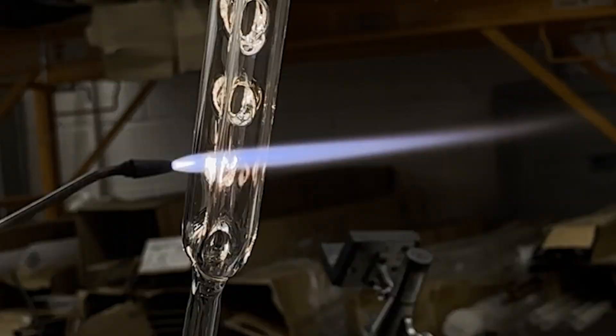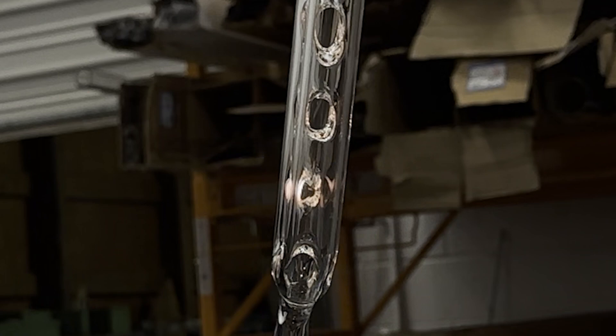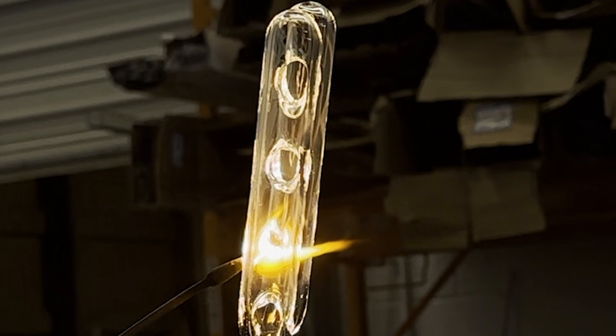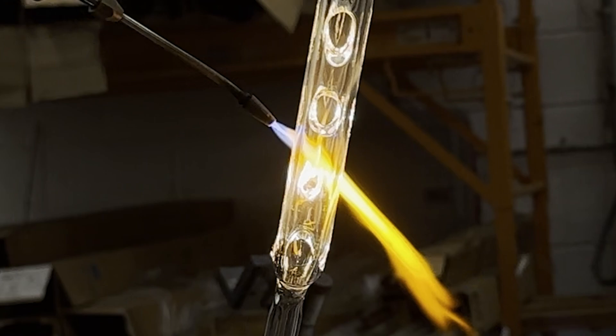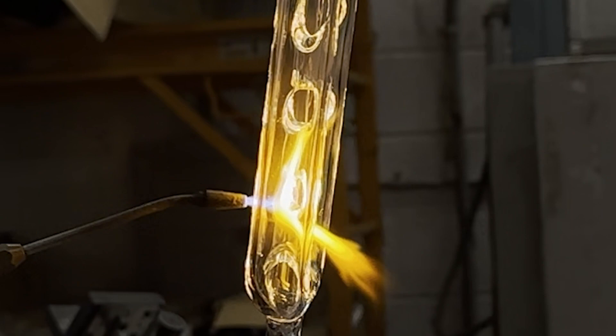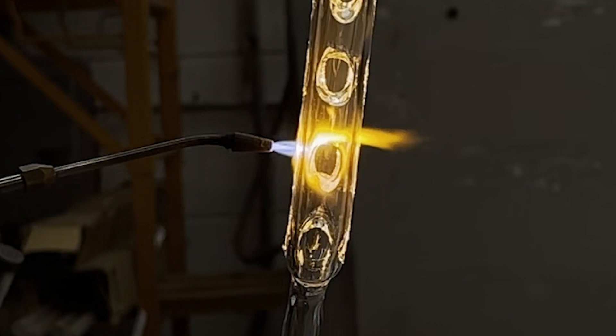The other danger is puffing too hard and popping the seal before the membrane breaks. The only way to fix this is by plugging the hole and trying again — sometimes this works, sometimes it doesn't. Again, the best way to deal with this is to avoid it. When done correctly, the Jesus seal is the fastest and cleanest way to create a hollow seal between two pieces. It is the logical alternative to double hollow seals, which are very difficult and require great skill.